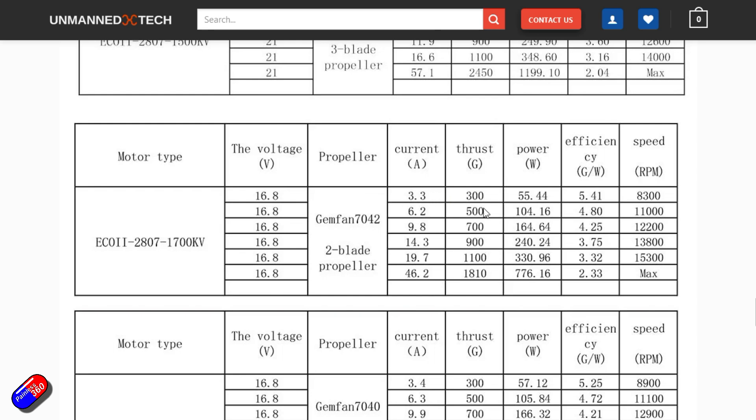It's not going to be anywhere near 3.3 amps per motor to keep this thing in the air if I can keep it at that 700-gram weight. So hopefully we're looking at more like 2.4 to 2.7 amps per motor — we'll have to fly it and see.